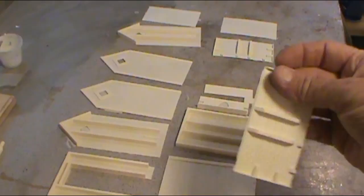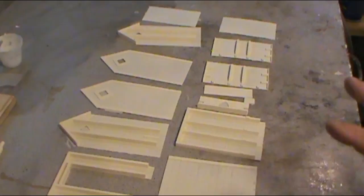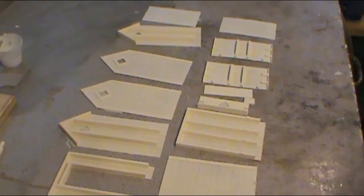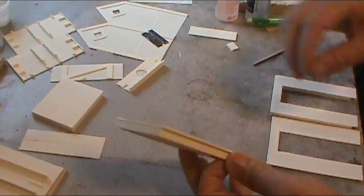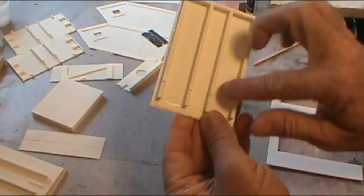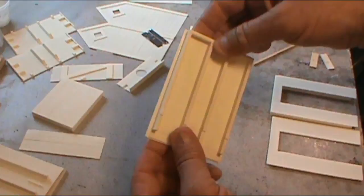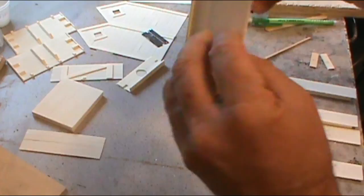These are very thin; they have all the neat markings on the wood and everything's really detailed. You have to take a skin and just lightly sand the back of it on both sides. Then I use epoxy so you can put them together and hold them or clamp them until it's dried. That gives you a whole wall — it actually makes it stronger because the two pieces glued together are stronger than just one thickness. Even the roof has an end interior part and then an exterior skin.